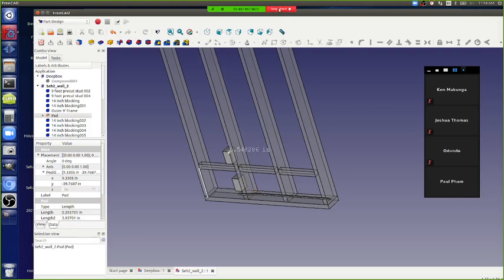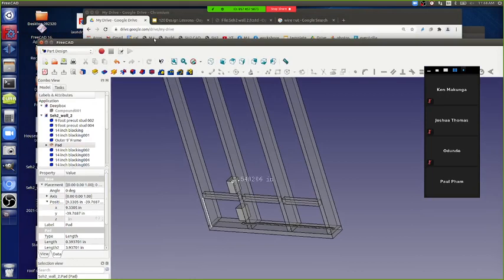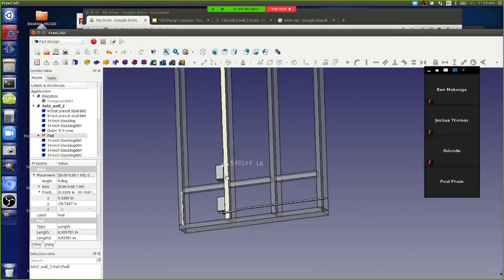Cool. Any questions about this? So you already have the electrical box. That wire in electrical boxes means you're using cutters. You cut the wire, it's a little stub. We just measure enough to go in there and stick out, say, 6 inches out the box, so you have enough working length once you're attaching, say, the outlet specifically.